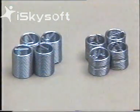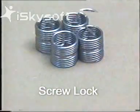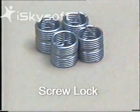They are made in two basic styles to cover all applications. Free running helicoil are similar to a conventional tapped hole, allowing the screw or bolt to pass through freely. The screw lock helicoil has one or more coils deformed, which initially prevents the screw from passing through.